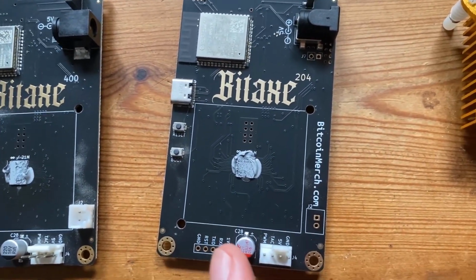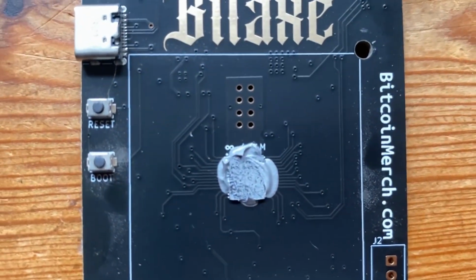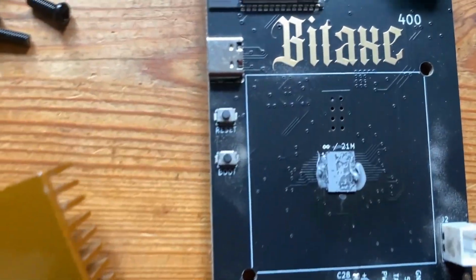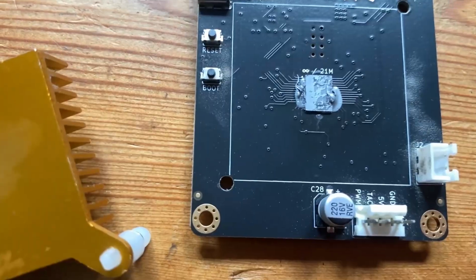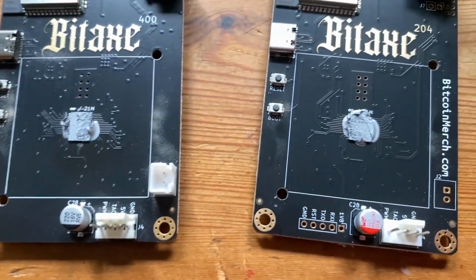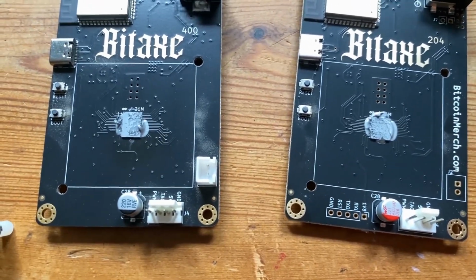We need to use a little less thermal paste, I believe, because look, you can see how much is surrounded and how much is left on there. So definitely we need to use way less thermal paste this time, maybe about half of what we used yesterday, but it's good to see under it, to see how the thermal paste actually functioned or squished against the chip.